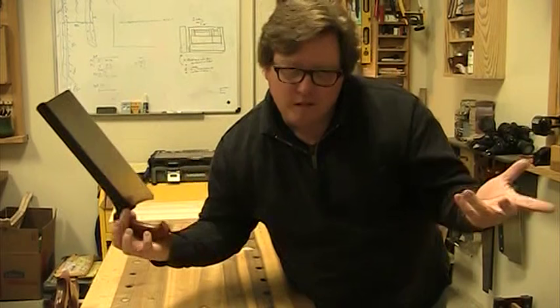So let's see how it does. Grab your board, slide it in the box — you can always prop the other end up. Get in the proper sawing stance, drop the saw in there, close your eyes, look away, do whatever you want, and you end up with a nice square cut. Job done. If you need to make multiple cuts, there's no reason you can't clamp this down, clamp a stop on the edge, and just bump it up and saw, bump it up and saw, again and again.